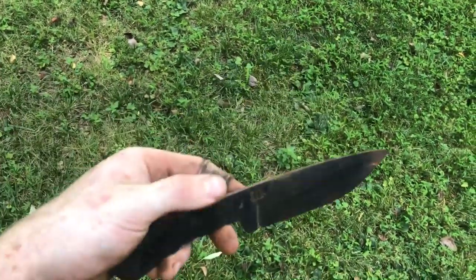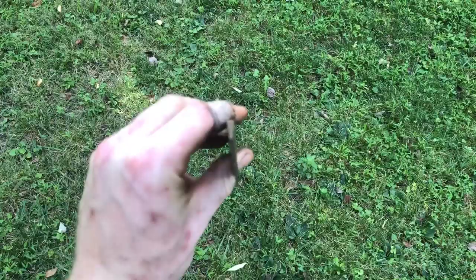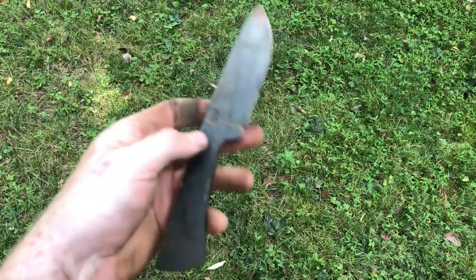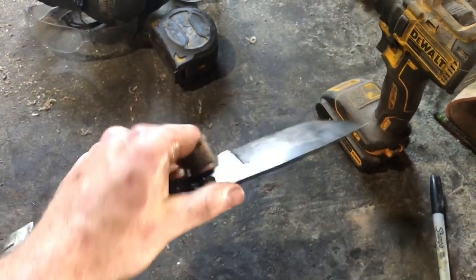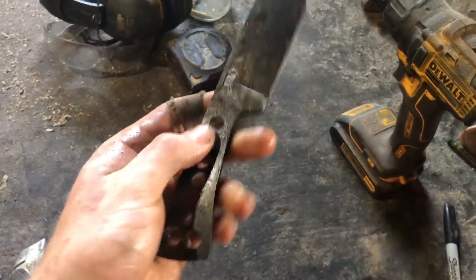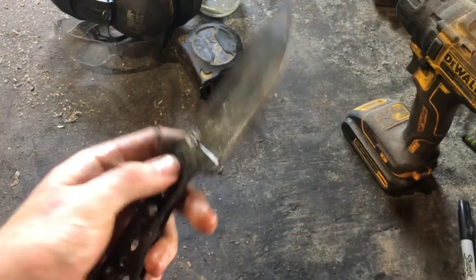It's about two weeks later and I'm finally getting another chance to work on this. It was tempered at 400°F for an hour and a half, twice — Rockwell is where I want it. There's still the tiniest bit of warping up at the very tip, but there's enough material to get that out in the grind. I'm going to put some heat into the tang since I forgot to drill the holes before heat treat, just to make sure it's nice and soft. Got two pin holes drilled plus a bunch of extra holes to reduce weight and give the epoxy something to grab onto.